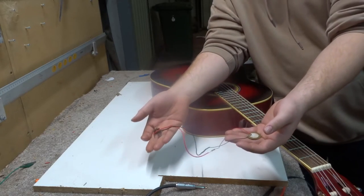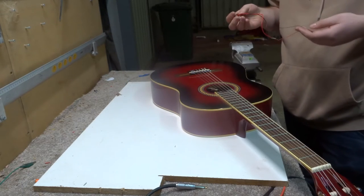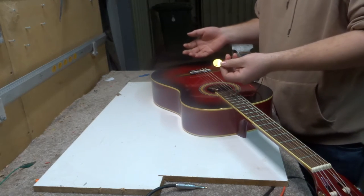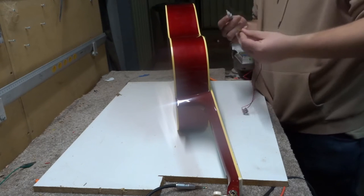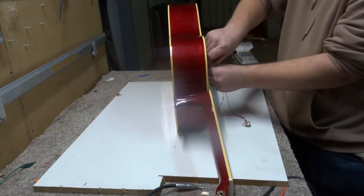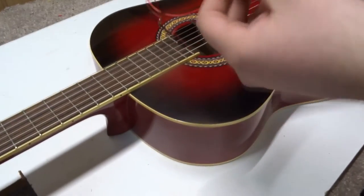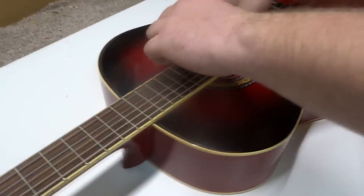This is what my harness looks like after I've soldered it together. You've got your resistor down there, piezo, and your jack. Now it's time to put it in. With your piezo, you want it glued directly under the bridge, because that's where the vibration comes from most. I've got the guitar up on its side so it's easier access for my hand to get behind the bridge. I'm going to use super glue because it sets quick and it's easier to maneuver in there, instead of using a hot glue gun. To make things easier, I've used an alligator clip and a cable to thread through the inside of the guitar, so I can get the jack into place. All I have to do is connect the jack to the clip, and Bob's your uncle.